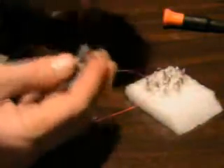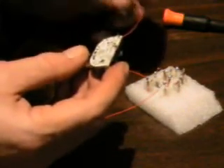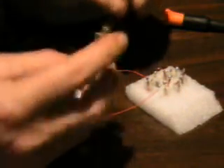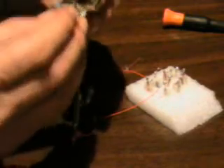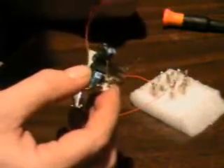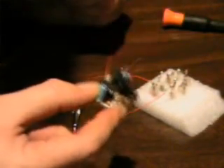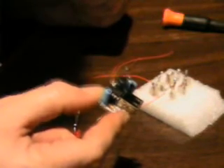What I'm going to try and do is use this DC-to-DC boost converter. It'll convert about 2 and a half to 3 volts up to 5 volts. Problem is at the moment it's got a few capacitors and resistors on there and there's just not enough throughput out of this little device to crank it up — when I hook this up I'm only getting about a half a volt to make its way through.